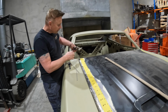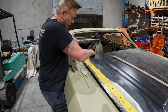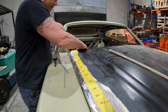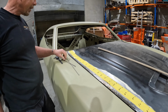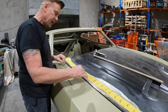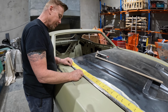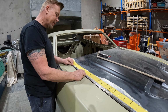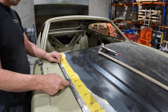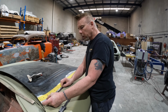The reason being, when you lift that up, you clamp it like that, and it'll just hold it nice and flat, and then go ahead and tack it on. The reason I wanted to keep these perfectly straight is that if there were variances in the edge, I can basically cover it by putting that on there, keeping it straight, tacking it up, putting a nice little straight edge.